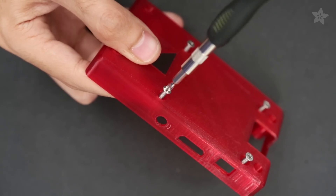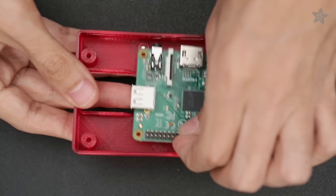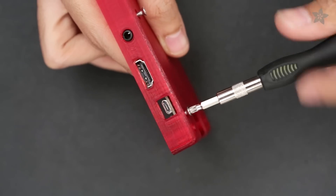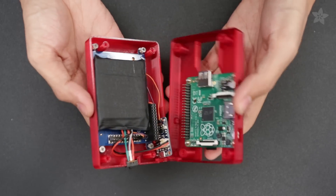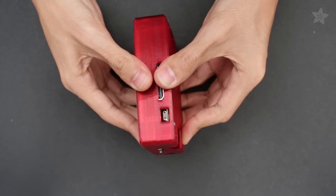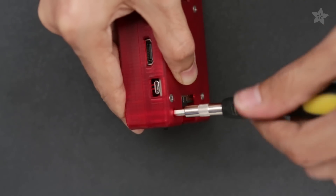It's a good idea to install machine screws before mounting the components — this helps line up the holes with the standoffs. We'll place the Raspberry Pi A Plus on top of the bottom half and line up the ports with the cutouts, then secure it in place by fastening the screws. Now all we need to do is join the two parts by connecting the display to the Pi, carefully lining up the headers to the connector and pressing the two parts together. To finish the build, we'll add four more machine screws to the bottom half of the enclosure and fasten the two parts together.